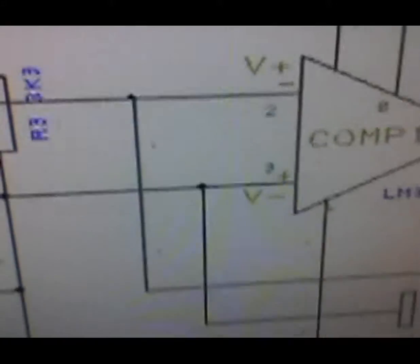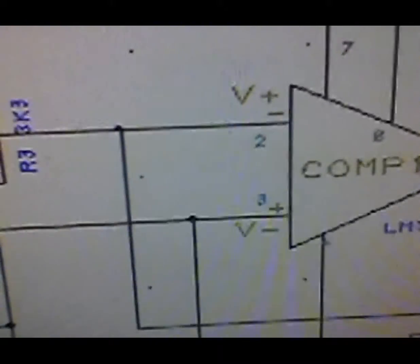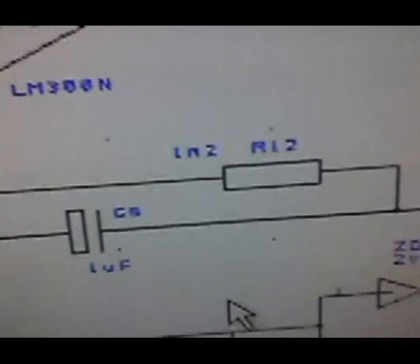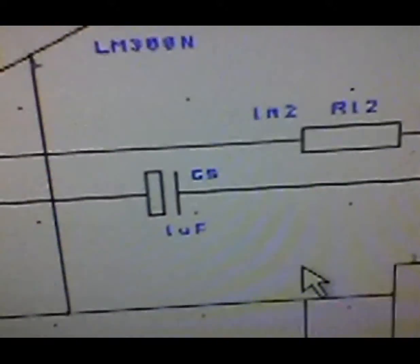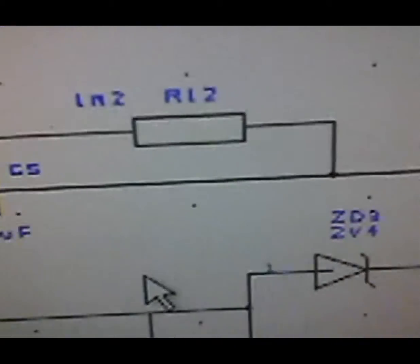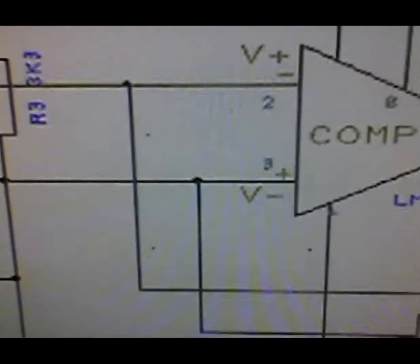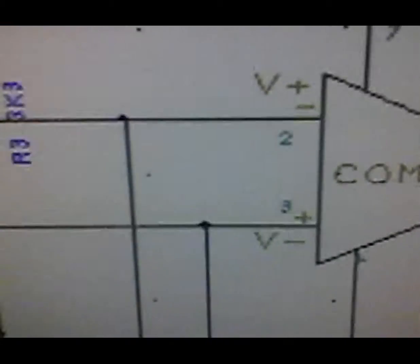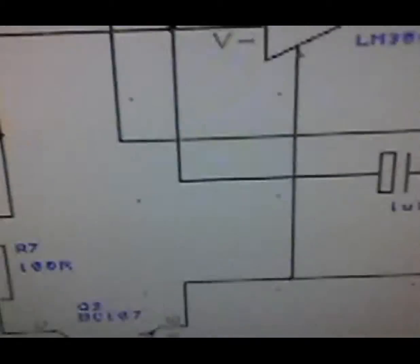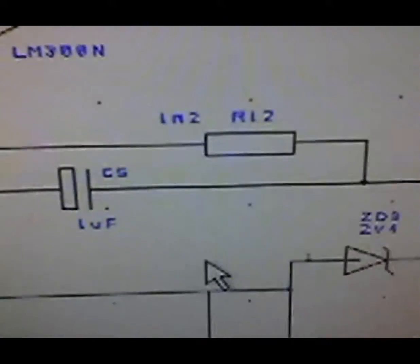Well, there was another amendment I had to make, and that is that the resistor goes to pin 2, and it wasn't wired in parallel with the capacitor, because I'd changed it and I forgot about that. So the actual capacitor still goes to pin 3, but the resistor goes to pin 2. Anyway, I'm going to put some update screenshots at the end of the video so that we can all get this straight.